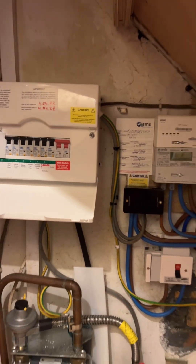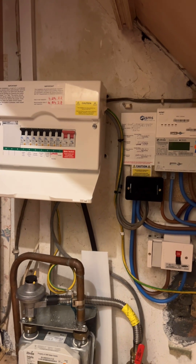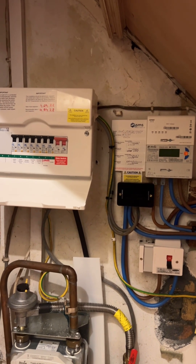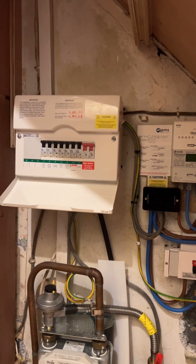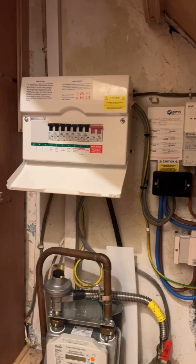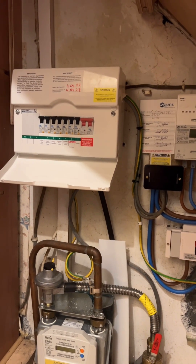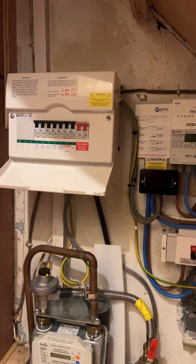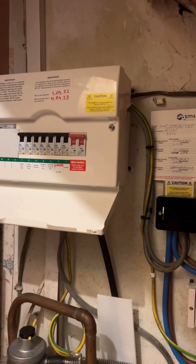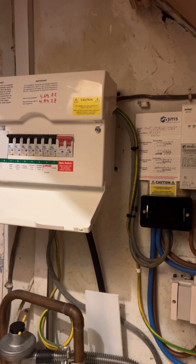And it's now come back on. We are now fully running purely off battery and solar. All the lights are on around the house, the auto doorbell connected to the mains is coming back on, the Wi-Fi is coming back on, and they can carry on cooking — the heating is remaining on. Very exciting. The system we've installed is Jinko panels at 435 watts to the roof, a SolarEdge system with an 8 kilowatt inverter and two 10 kilowatt batteries giving 20 kilowatts of storage. It's all registered with the DNO and MCS registered — another system complete.